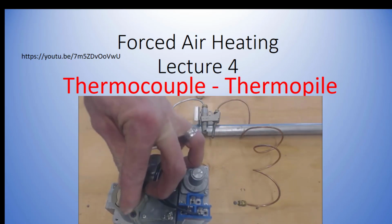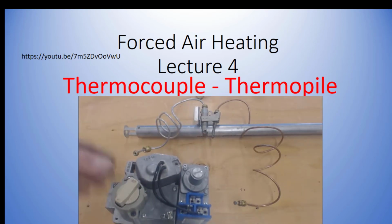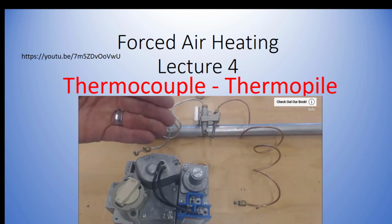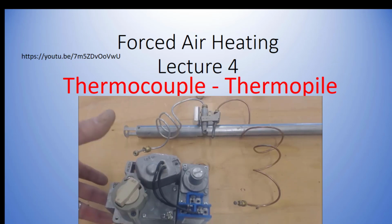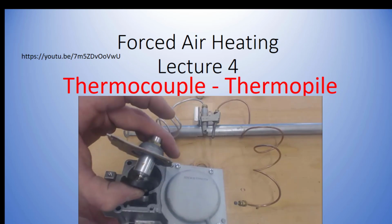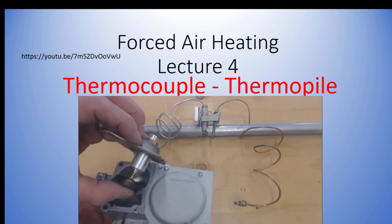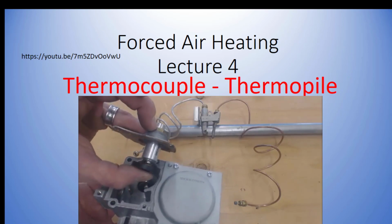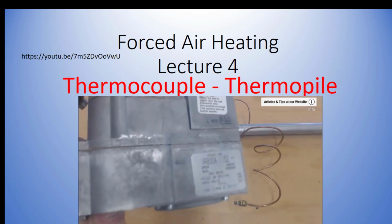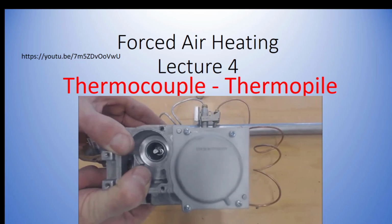All right, but as far as the pilot goes, say you're holding this button down and you're allowing gas to flow through, and you're lighting it, and you have a flame. Anytime that you let up on this, after a minute, two minutes, three minutes, the flame ends up going out. Well, that has to do with either the thermocouple or, inside the combination gas valve, what's called a solenoid. This solenoid right here is powered by DC millivolts, and you actually are pressing this down, just like this, anytime that you press this button right here. So you see how I'm depressing this right here?